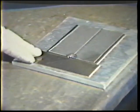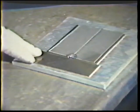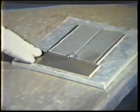Position a third plate at the end of the joint. During welding, the argon shielding gas tends to flow down the joint and escape, leaving the root open to oxidation. By placing a plate at the end of the joint, the gas is trapped under the joint and protects the root.